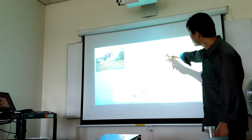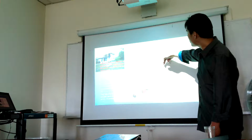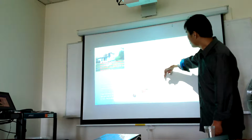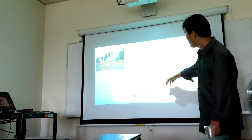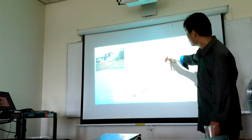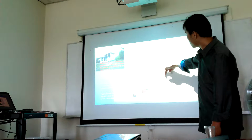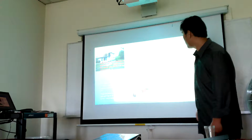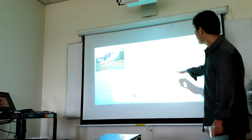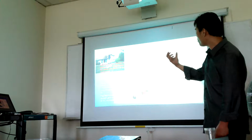And you can also see that if the rain penetrates inside here, and the drop comes from here, we have our flashing. We call that flashing. It drops onto the air barrier, and just like that, it can go from here to the outside. So that is the function of the two barriers.